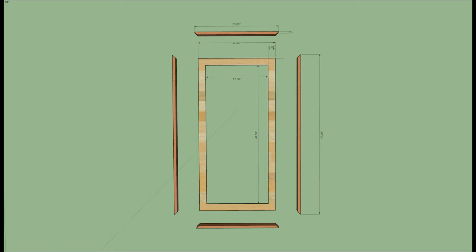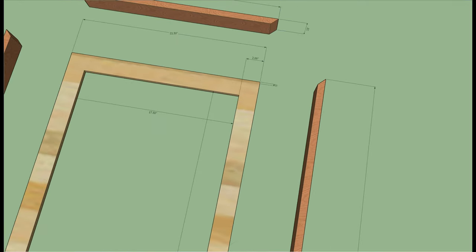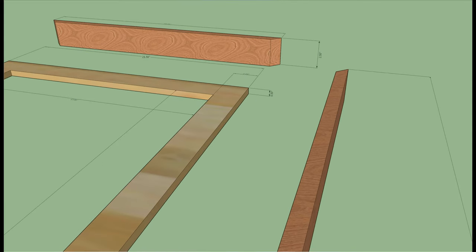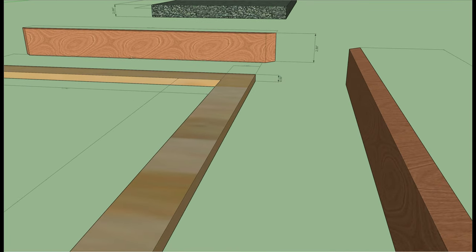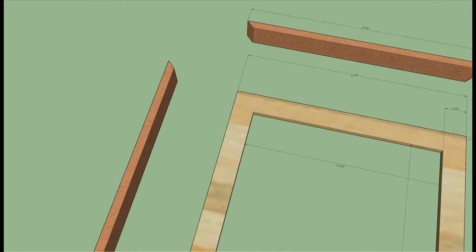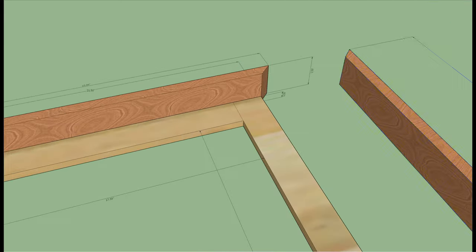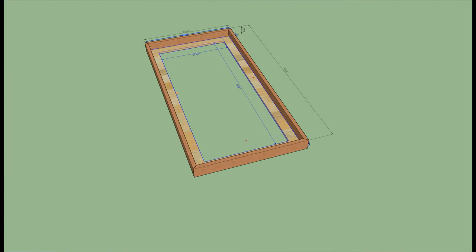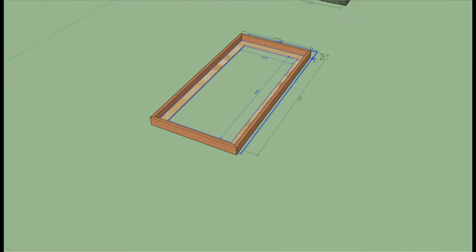To begin, let's go over the 3D model I put together to give you a better understanding of how it's assembled. I start with a half inch thick piece of plywood with the majority of it cut out. That will be the back plate the mineral wool rests on and the wall mounts are attached to. Surrounding it with perfect 45 degree angle cuts are square edge 1x3 boards. These will attach to the plywood with 18 gauge brad nails. The outer edge boards will attach with glue and 3/4 inch brad nails. All that will be shown in the video. The mineral wool will rest in this compartment.